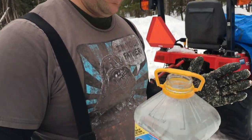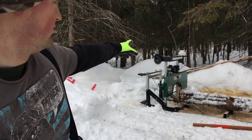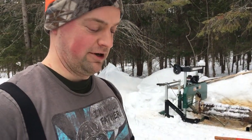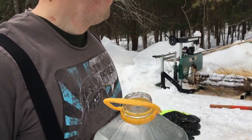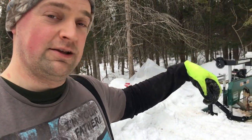Thank you for my water, Andrea. The water is used to lubricate the blade. On top of the sawmill there's a translucent plastic container that holds about four liters of water. I can turn a lever that runs a water line down to the blade so it drips directly on it, keeping the blade lubricated and from getting too hot, which makes the whole saw work much easier. On colder days in winter I have to use windshield washer antifreeze fluid rated to minus 40, but today it's just a little above zero so water is fine.